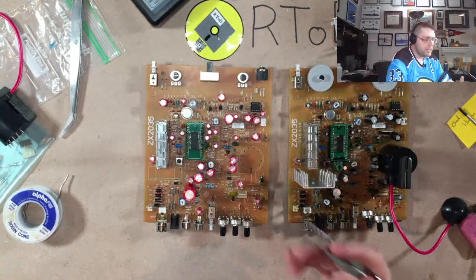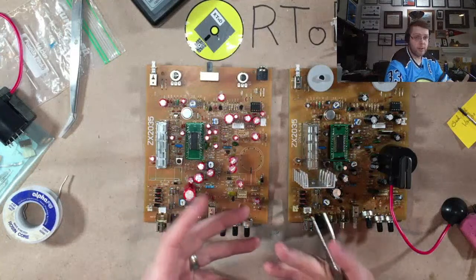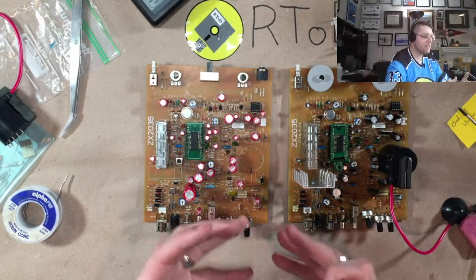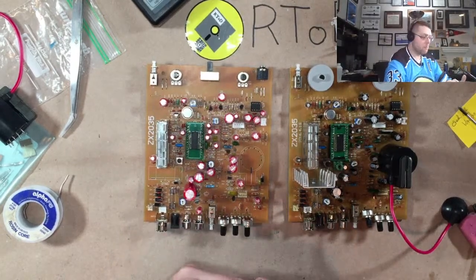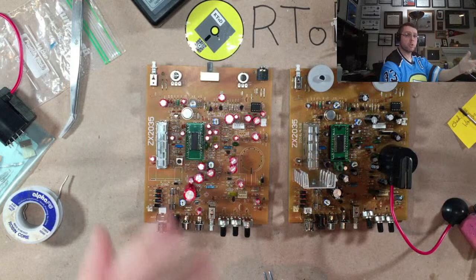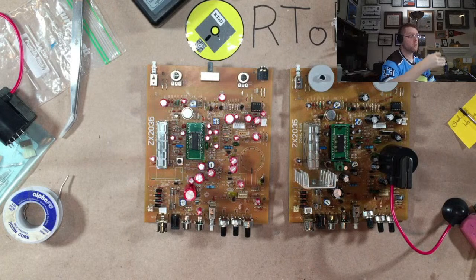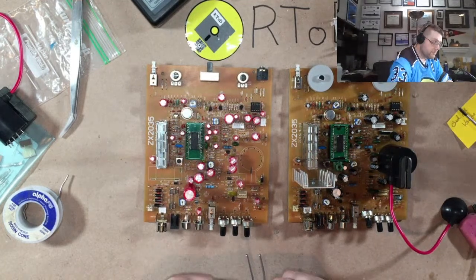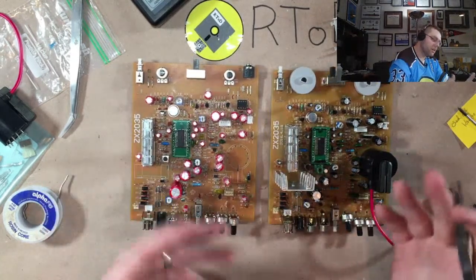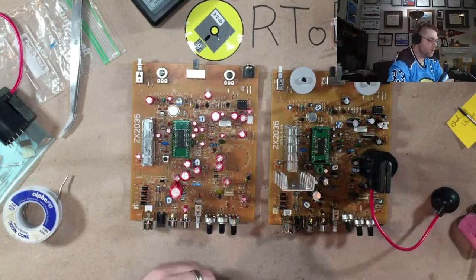Or he would go up to 18, slightly over, but still what should be in tolerance for a standard capacitor, and it would fail, it would blow up. But then he would get a Panasonic, a Worth, any capacitor worth its weight, put almost twice the amount of voltage through it, and it would hold it. The capacitor would do its job. Not only would it hold 12 volts like it's rated to, but it would hold 24, sometimes a little bit more. All of that compounded makes me lose confidence in the parts that were supplied with this kit.